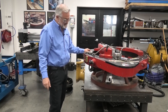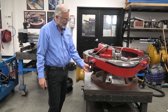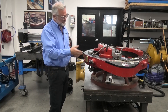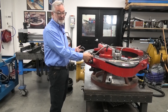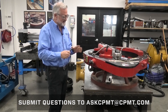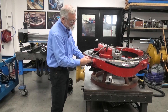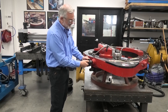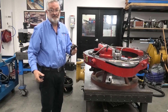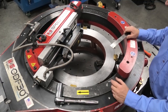Now that I've set the machine down roughly onto the workpiece, I have the option to take my lifting eyes off if they're in the way — such as when they're interfering with adjusting the foot, or if I'm in a position where they might come in contact with the feed or any other rotating object. These just use the provided wrench and unthread; the bolt is retained as part of the lifting eye. Just take them off and set them in the toolbox until you're ready to lift the machine again.